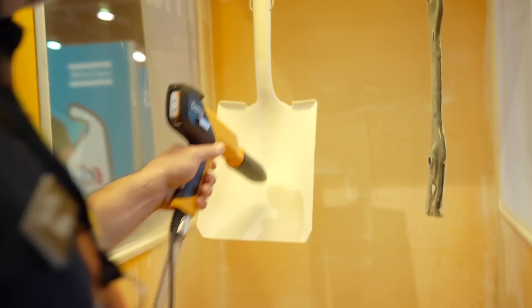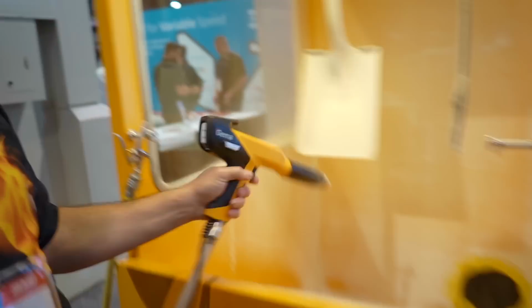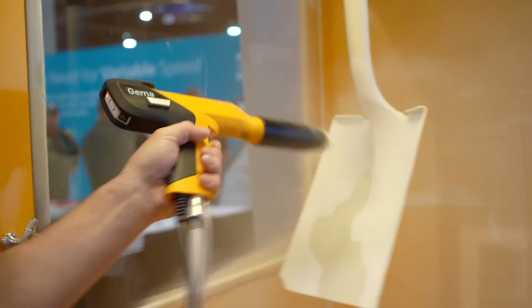However then, when we're wet painting, if we get a run, we kind of roll up in a ball and cry a little bit. I can make an error with powder. I can get too much powder on. You can see it. It doesn't look good, but I can take air, blow it back off a little bit, and then I can touch it up, or I can start over. And then you heat it up, and you're done.